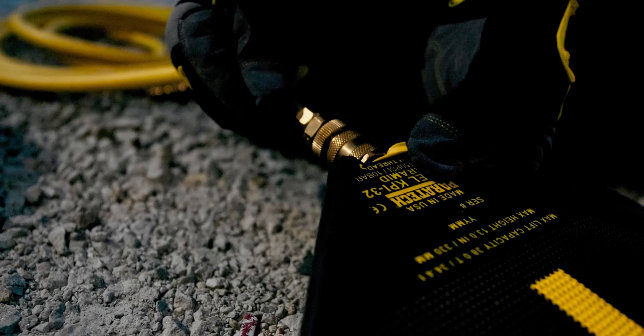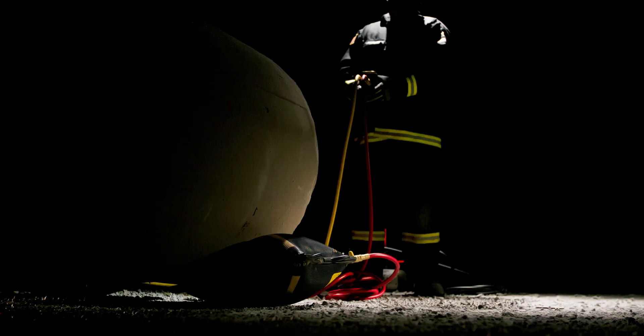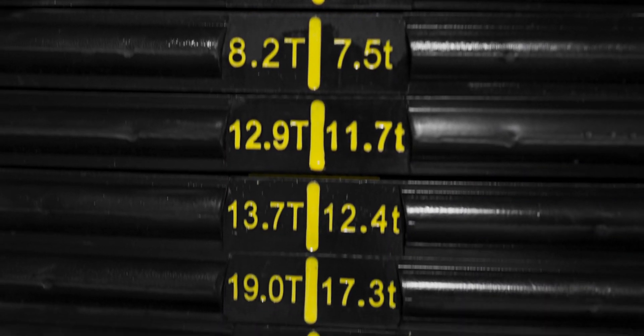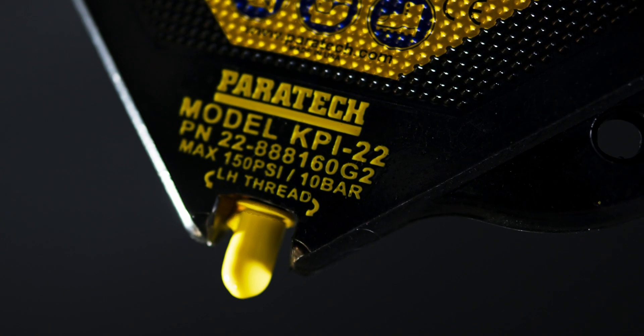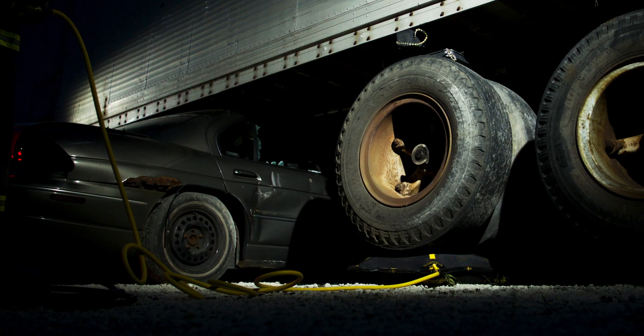Meet the latest generation of MaxiForce. It's next-gen — much more capable in terms of its lifting capacities. You get your lift capacity by two things: area and pressure — that's what develops your force. We kept the same footprint because we have so many bags on trucks out in the field. We have all our markings on the bag with the tonnage it can handle, the air pressures, and the recessed nipple — the rubber from the bag is molded around the nipple to help protect it. It was always being dropped on and dragged across the ground, so that helped a lot. Its insertion is very thin — the biggest bag is only an inch thick. It's pretty amazing to see the amount of force and dead load that they can lift.